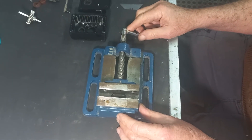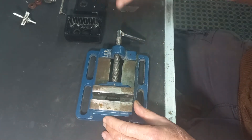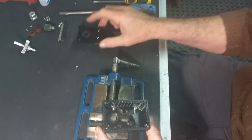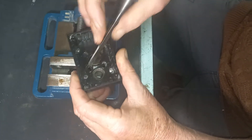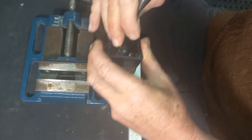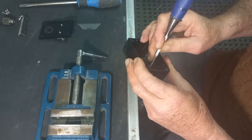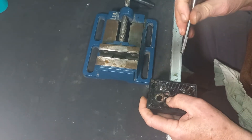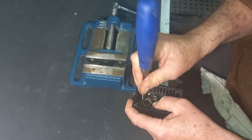I'm going to give you some snippets of the information that you need that's not in the video. So obviously at this point your gearbox looks something like that — the bush is out, that bush is loose. First thing you have to do on your box when it's fully cleaned is inside there you need to scrape away all the glue, the old glue. Use a chisel or something like that. Just clean that up and make sure there's nothing that sticks up — no little burrs, no lumps.